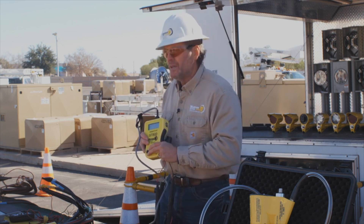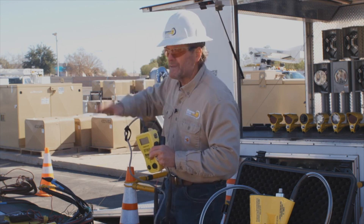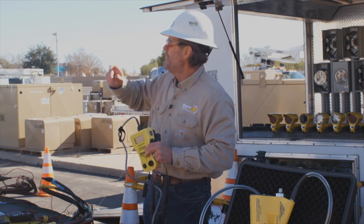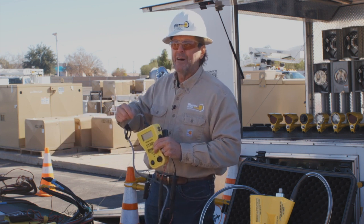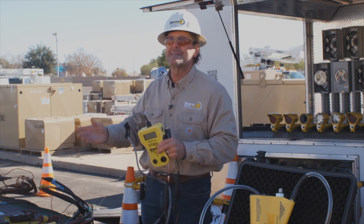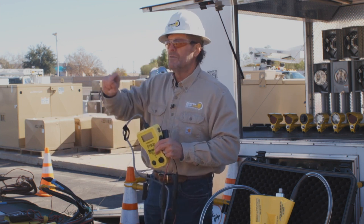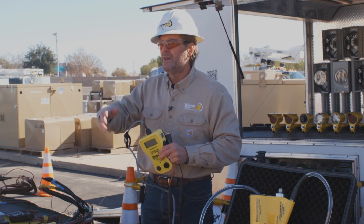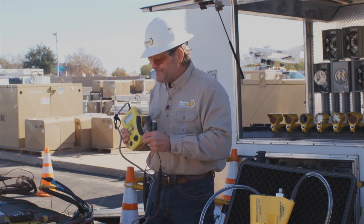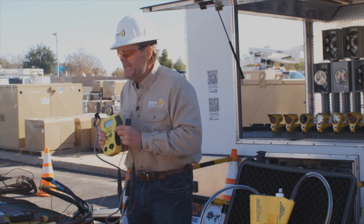After making the repair, you go back to hot leg to neutral. You look at the voltage, you see 120 volts, and you're hoping to see 14 amp jumps. You turn it on and you do — you see it climb up. It took 60 counts to get to 800 before; now it takes maybe 64 or 68 counts to get to 800. It stops counting, holds. Your neutral is good, your repair is good, there are no other issues — you're done.